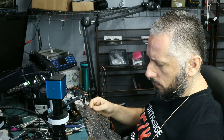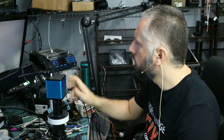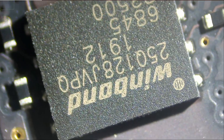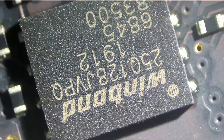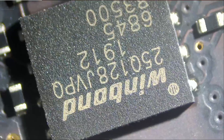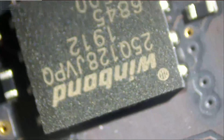It should be on this side if there's one. Right there — got it. So the 2019 iMac does have an EFI chip. We do not know how the firmware is structured internally. Usually what we do is read from the chip, locate the $SVS tag within the firmware, erase it to reset the password, and that's how it's done. We do not know if the programming of this chip is the same, but the chip is the same — this is the Winbond EFI chip.